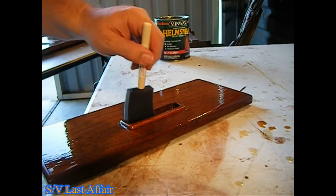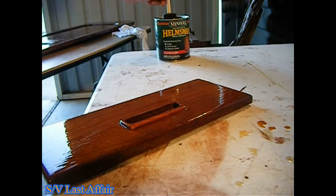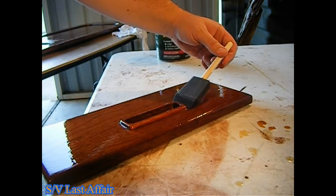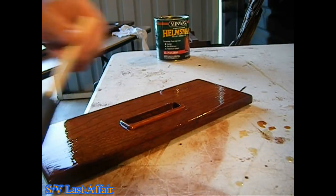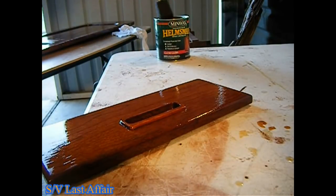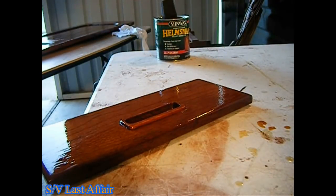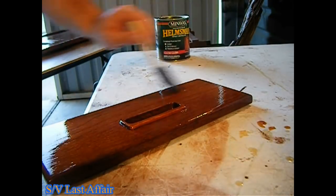On these, I'm going to get a little bit inside here — it's tough to get the brush strokes out, so I'm going very light. I'll add just a tad more varnish, go over the top edge, and where these handles are, lightly touch in here and stroke outward to get rid of the brush strokes, then do the same on the other side, making sure my strokes go the whole length of the wood. That takes out the majority of brush strokes. I can see little sections where I didn't cover well — I'll make that correction and feather it out.